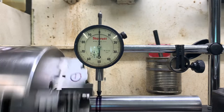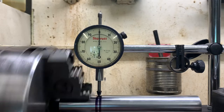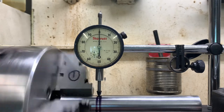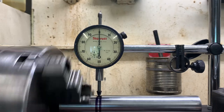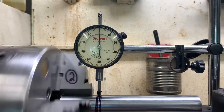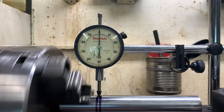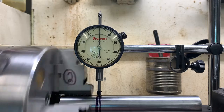The backing plate is running true. The face of the chuck with the jaws out of it is running true. I put the jaws back in it and right up next to the chuck I can't get any closer than what I am right now. I've got it indicated in and I can't do any better than that — the needle is barely moving.